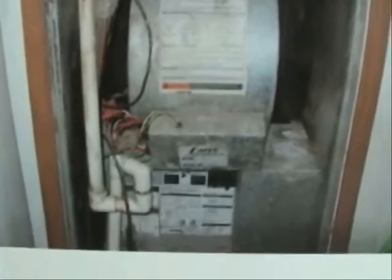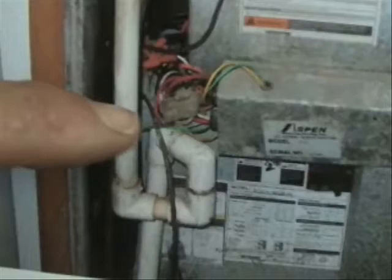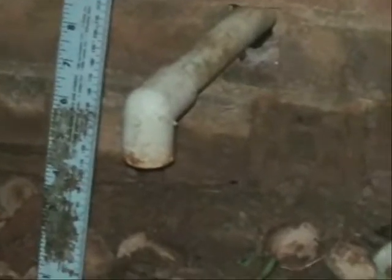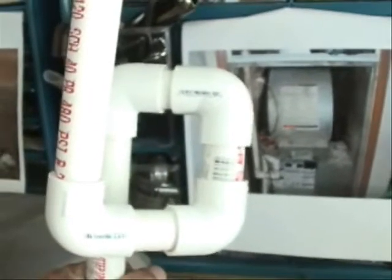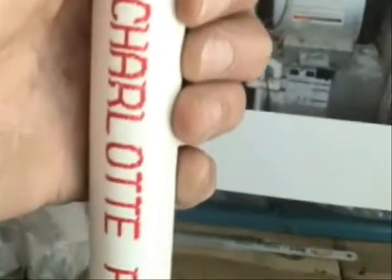Here's the blower in her air handler. And right here is the P-trap that's inside of her air handler. What I've done is I've made up an estimation of what that P-trap looks like. You should be able to see the contrast here — you have the tubing coming down and going through this little trap here, and then after going through this trap, the condensate continues outside.